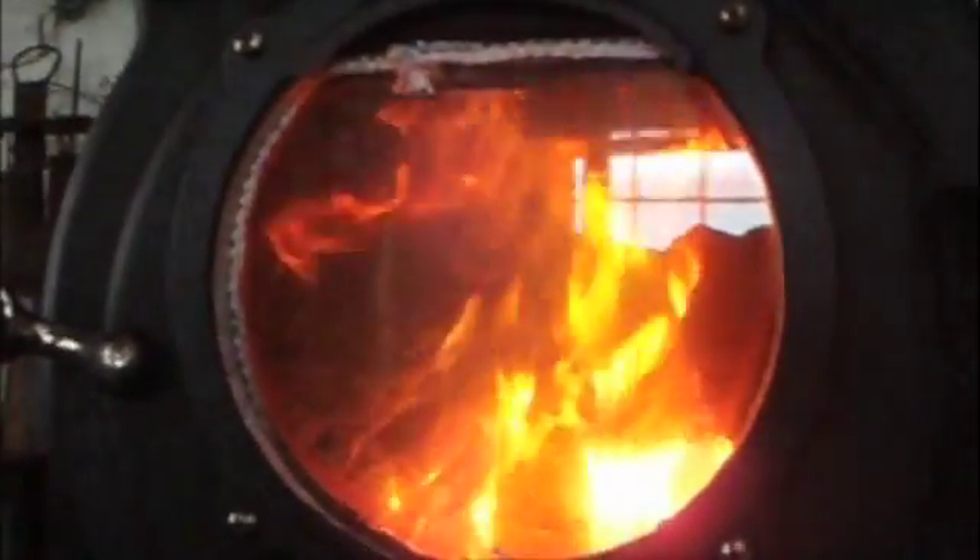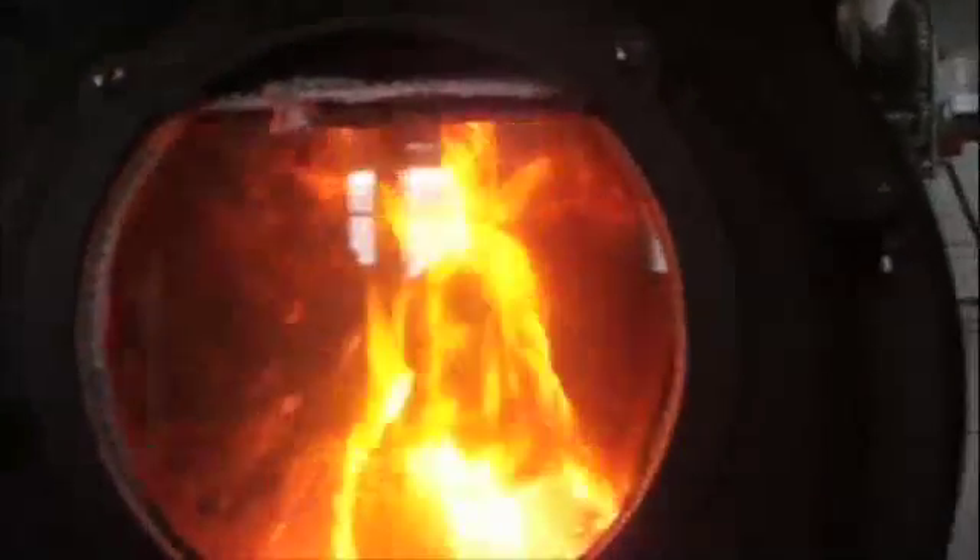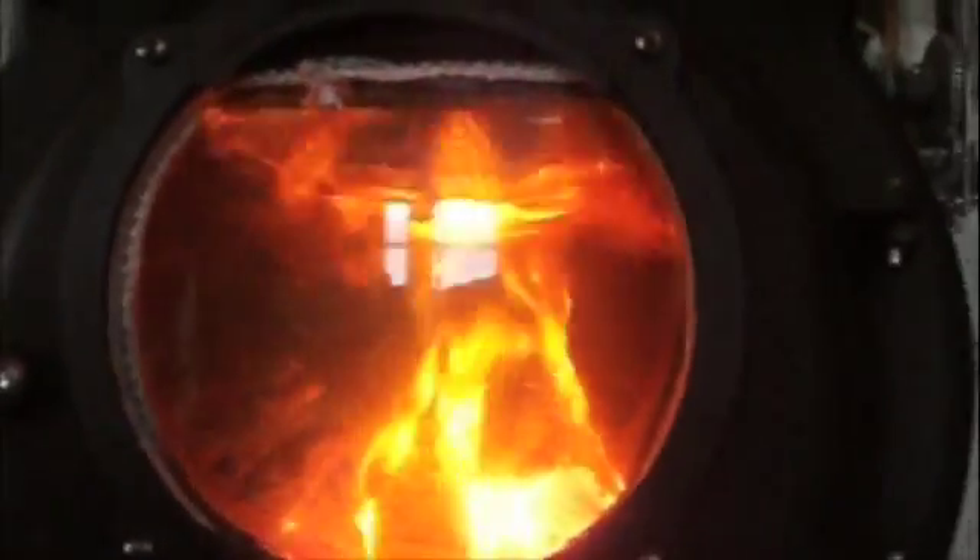Now the trick will be to be still enough so you can see the flame action from those tubes. There are several factors that are very important in secondary combustion: ample insulation of the stove — meaning the fire bricks keeping the heat in — then the baffle in the upper part of the firebox, the air tubes bringing in 700-degree air, and a healthy bed of hot coals with active primary flames.